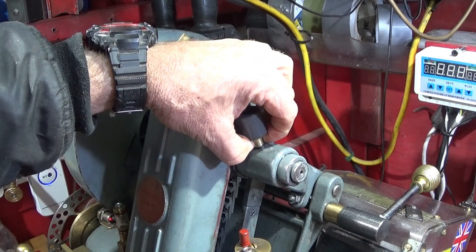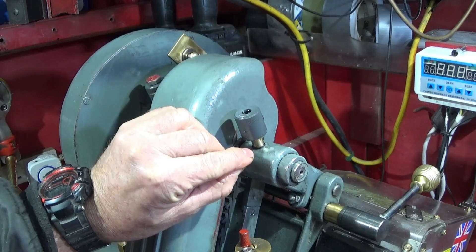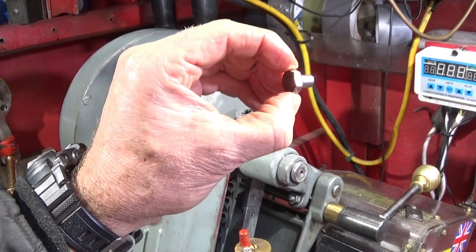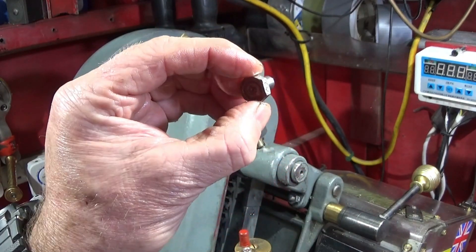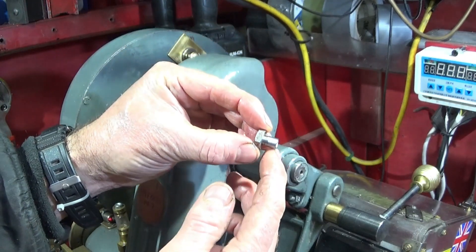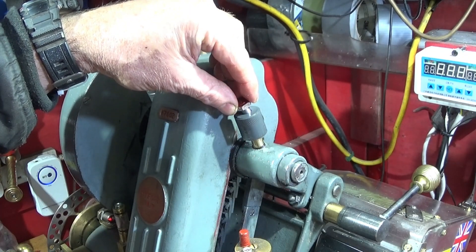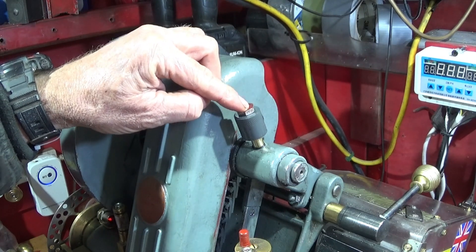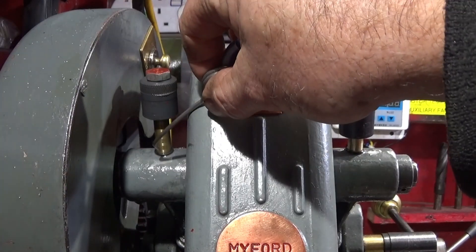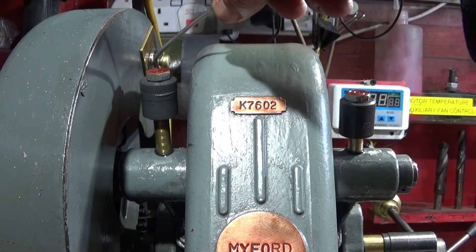This is just a push fit into the housing of the countershaft there, but I did put a groove on the end with a small O-ring which sits in the bore. Then I simply got some 1/8th BSP blanking caps and turned the thread off so it actually fitted the bore on the top here. I put a groove — an undercut — at the back so that when it goes down into the bore it locks in on the actual O-ring that's in the bore. I've done exactly the same at the back here, although I've made this one longer so that I don't have to reach down in between the guards on the back.